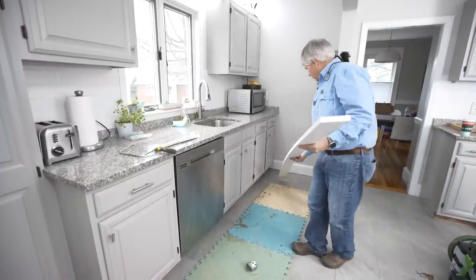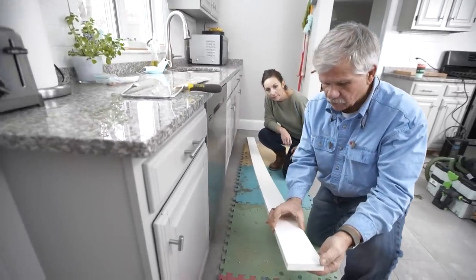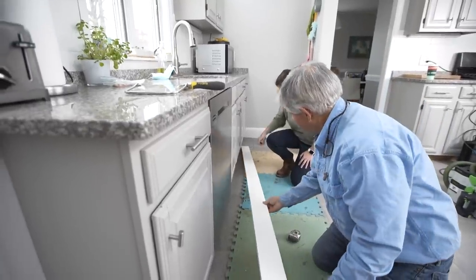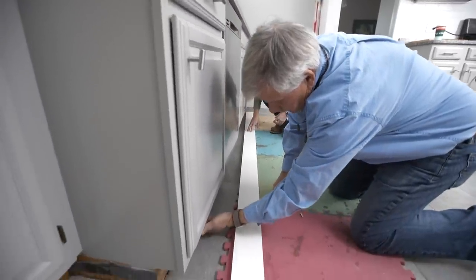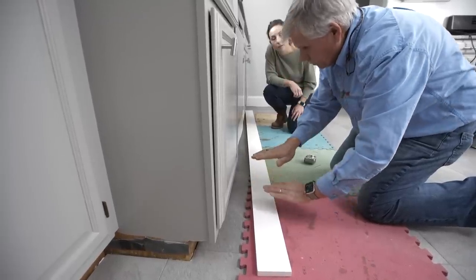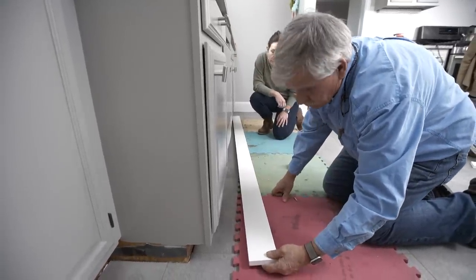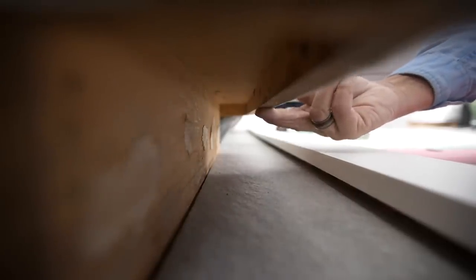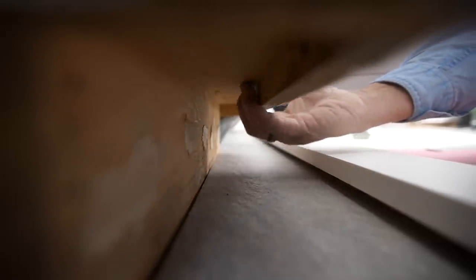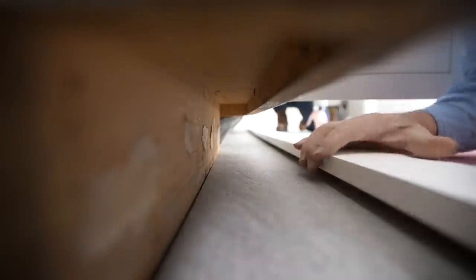Here's the piece of PVC trim — a 1x4, which means it's three-quarters of an inch thick and three and a half inches wide. The base is going to sit right under the cabinet where the old one went. Now your floor is straight but the cabinets are still at a little bit of an angle, so this has a wedge shape to it — we have to scribe it to fit underneath at the top. First thing I look at is the inside of the cabinet: the floor of the cabinet is up much higher, and the space between the bottom edge and the underside of the cabinet floor is probably three-quarters to one inch.